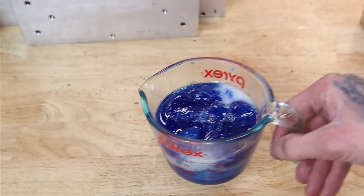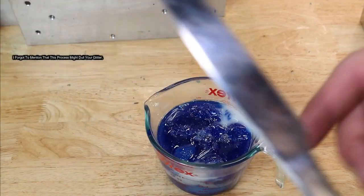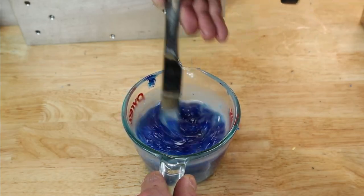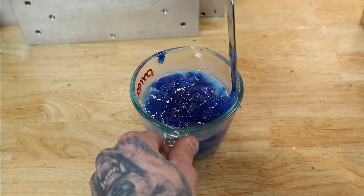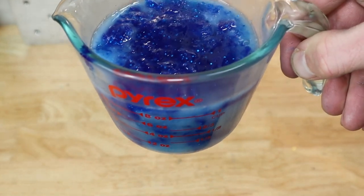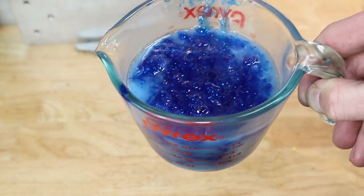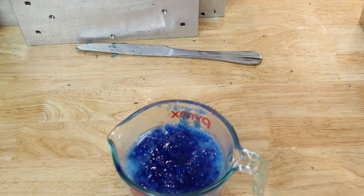This is what this looks like about 2.5 minutes in with a 900 watt microwave, I believe. So when we get it here, we'll just mix it around, kind of stir everything in there. When I put Plastisol in with a color like this, instead of just running the whole thing out of color and then making 100% new color, it's easier, but you kind of have to babysit it a little more, kind of mix it just so it doesn't burn.